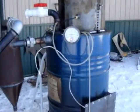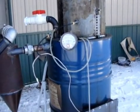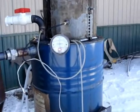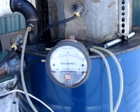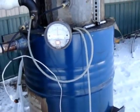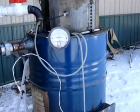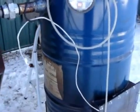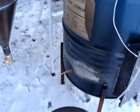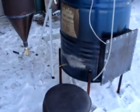I have a magna-helic gauge which I use to measure the pressure inside my hopper as well as downstream of the hopper, which would be this port right here. I'm trying to monitor the pressure across my hearth and/or across the orifice plate to see if that gives me any indications as to when to shake the grate. I have a thermocouple wire going into my orifice plate so I can measure that temperature, and down here I have another port where I'll measure the temperature at the grate.